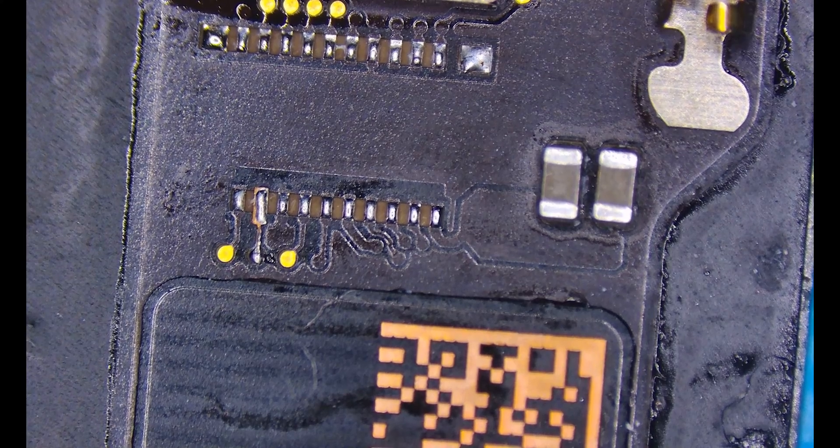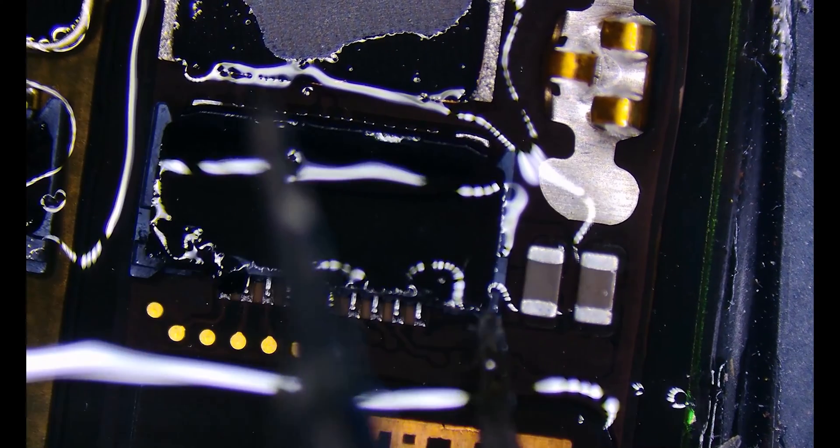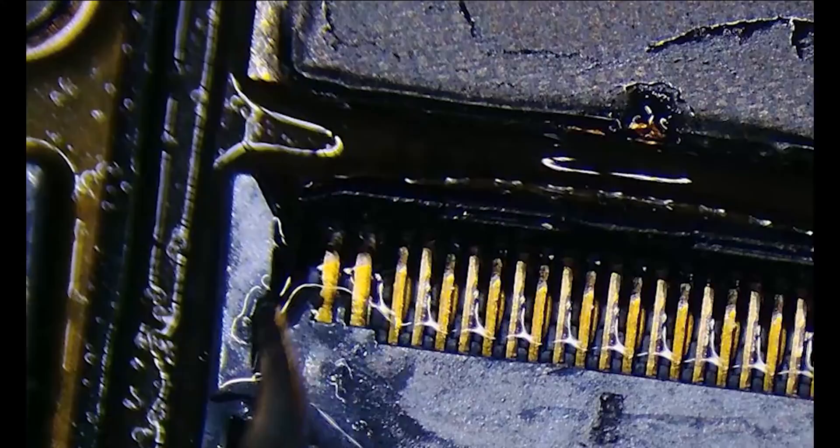If you're liking what you see then smash that like button and subscribe if you haven't already. Looking good — I'm going to get our new connector, and I'm actually going to steal this from a broken display. These connectors aren't something that are readily available, but I do enough watches that I have access to them. Adding isopropyl alcohol, I'll be able to carefully remove the sticker and pull it away to have access to the clean connector. I need to save this connector so I'm going to be extra careful when prying out the little arms that hold the swivel points for the connector itself, pushing them out as I carefully slide out the flap of the ZIF connector.